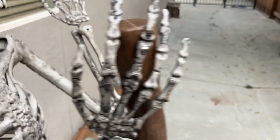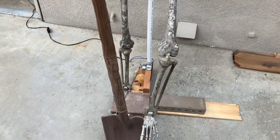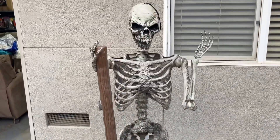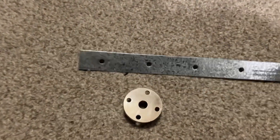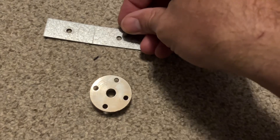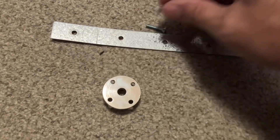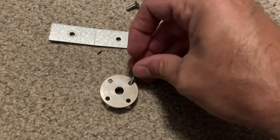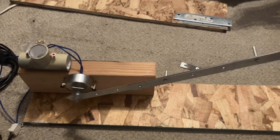Going up, I have the hand screwed to the plastic shovel. You get these synchronous motor adapters — I'll have the links in the description. You're going to use these galvanized little brackets, and number six screws work best for this, along with nuts. If you use a number eight it goes through the bracket but won't go through the synchronous motor adapter — that's why you need a number six, and it will go through both the bracket and the adapter.